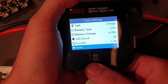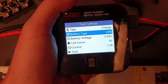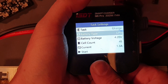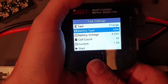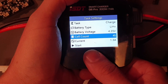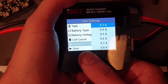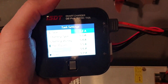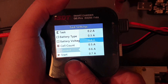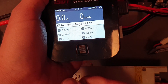So now I could do storage charge, discharge, or just a normal charge. But these are high voltage ones, so I need to go into the battery type — Lithium High Voltage, 4.35 volts, 4S, and set the current. The USB charger that came with these charges at 2.2 amps, but I'm going to set mine to 0.4 amps. And charge.